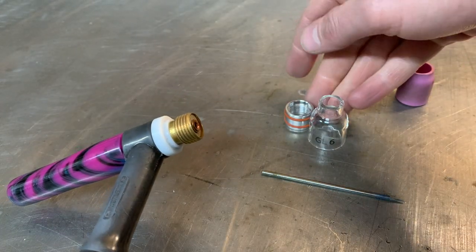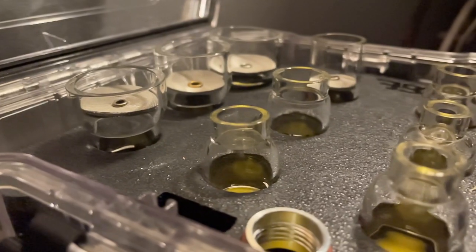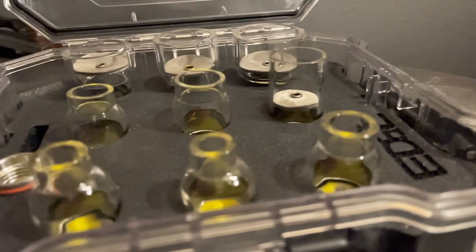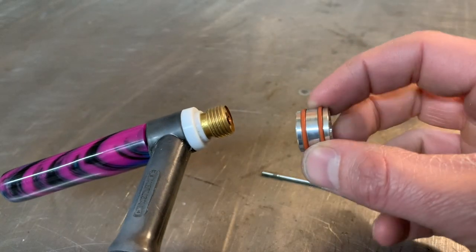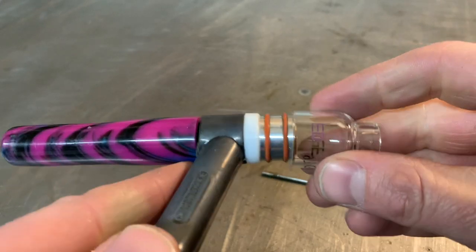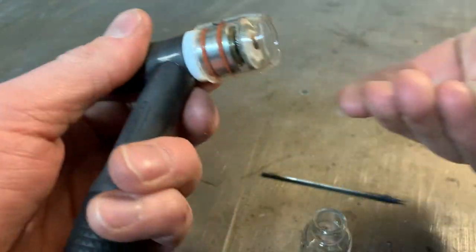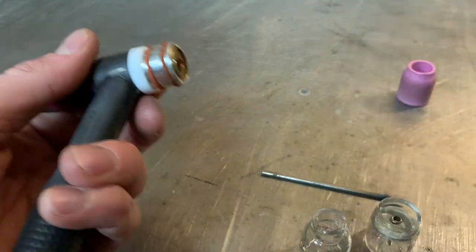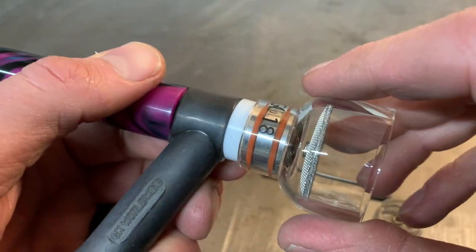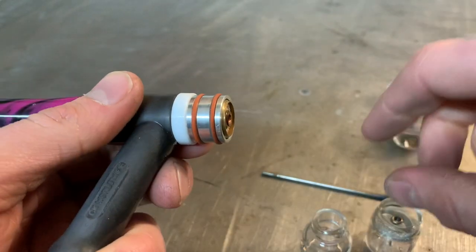As everybody on my channel knows, I'm a big fan of edge cups. Edge cups are super dope — they make a ton of different cups, different varieties and sizes for different applications and different types of gas volume you can deliver out of a TIG torch. This silver adapter just goes over the existing gas lens and then your glass cup slides over the O-rings. The great thing about these edge cups is you literally just pop them off and pop another one on. You can even use a super extreme cup — this is an 18 size cup, super extreme, but that'll get it done for large volumes of gas.